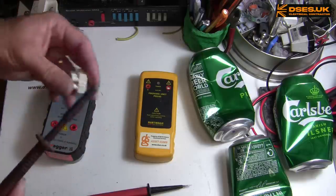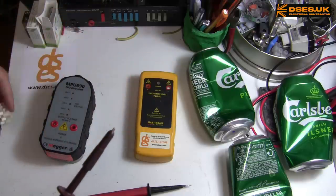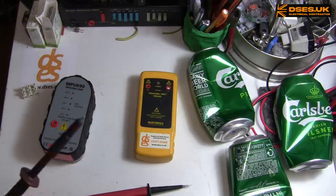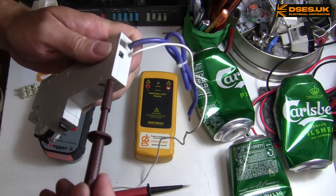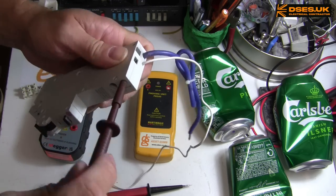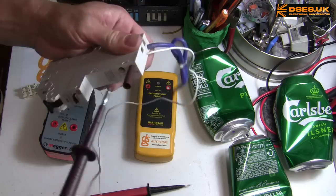The shroud stops it penetrating into some terminals. And the tiny tip doesn't always penetrate to live metal, as it gets lost in the recess of something like a screw head, meaning you're not sure if something it's testing is dead, or if the bloody probe just hasn't made effective contact.